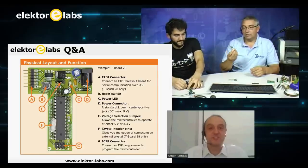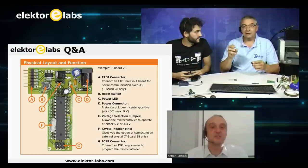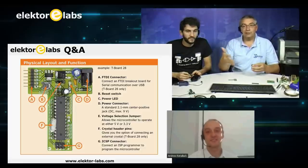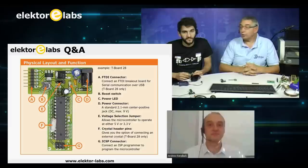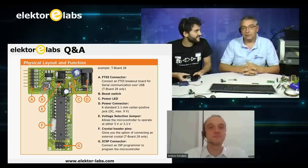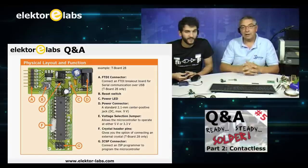And then, of course, as you also mentioned earlier, Jan, you don't want to always use an Atmega 328. Sometimes you want to use an 8 or an ATtiny. I think that's one of the main advantages. If you have a small board like this, with a DIP 8 on it, you can do a small program just to keep some LEDs flashing, or maybe open a garage door or something. But you don't need to buy a complete kit of a BeagleBone or an Arduino or whatever, because every time you need to buy a complete new Arduino or BeagleBone. So this is far better for me, according to me.